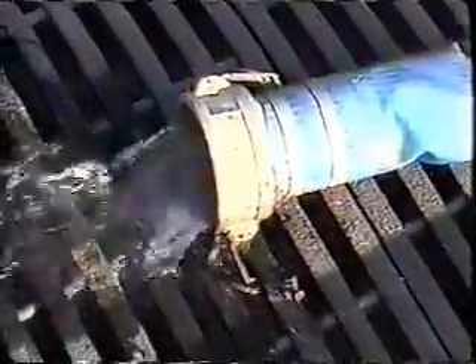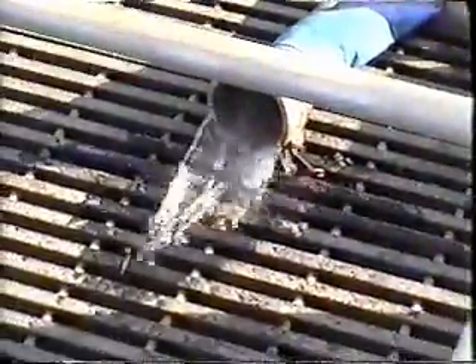And then you look over here, the wall screen is filling up real well. We're getting a little bit of surplus polymer coming through, so it's flocking the water just a little bit. You can kind of see where the flock's forming up on the discharge. Our water intake shut off prematurely, and we've got a lot more polymer into the system. Getting a nice, good flow out of there.